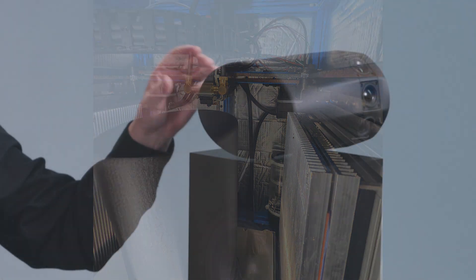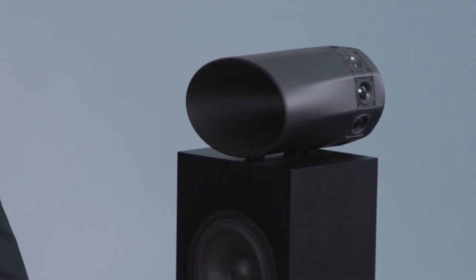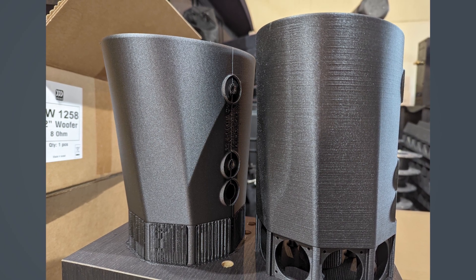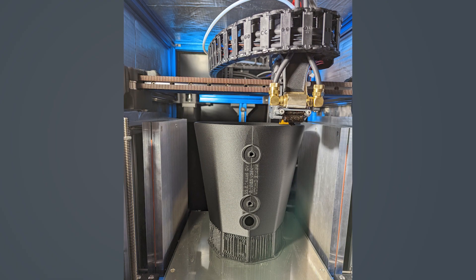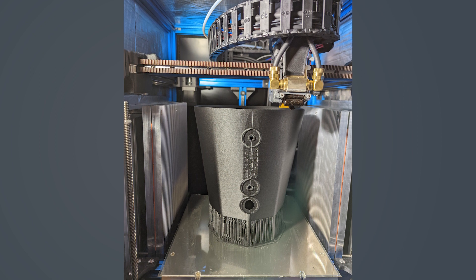The point array is comprised of a 3D printed part of carbon-filled copolyester. As we got closer and closer to the final solution of what was required to get the sonics that we needed, we realized 3D printing was the most practical — if not the only — way to produce the point array.